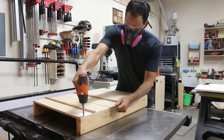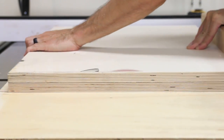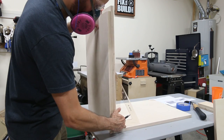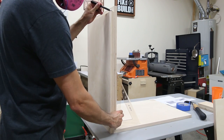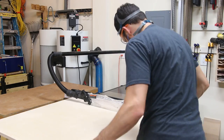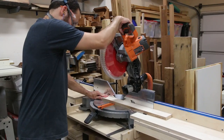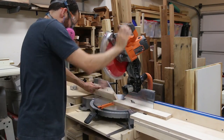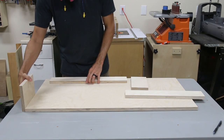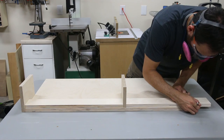If your sled is too narrow like mine, you might have to remove the front fence for this operation. The height of the sides will make the center line of the lathe even with my elbow after final assembly. To make sure the top would be level, I lined up the center divider with the side and then I marked for the cut. I'll be using this referential measuring method versus a tape measure throughout the build to help keep things perfectly aligned. Next I ripped some strips for the top supports which will hold the sides and the center divider together. The cabinet has 19 and a quarter inch drawers on the left and a 13 and a half inch drawer on the right. I cut the top supports to size for the left side first, then I used the pieces to mark the cut for the right side supports.